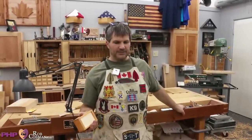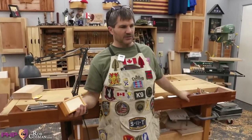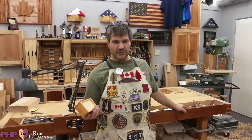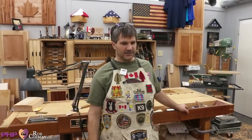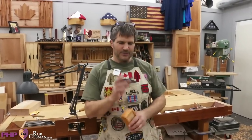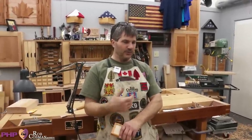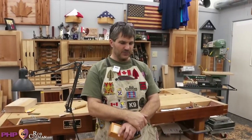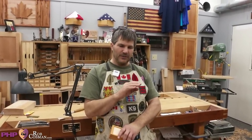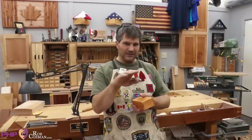Well, you know, there's all kinds of stuff out there today. My issue with it is it's messy, it's not convenient. And I'm not worried about wearing out the stones, because if you're doing chisel backs, which is what uses your stone the most heavily, you only do it once, and your sharpening from then on is mere seconds. So they last a long time. But I'm not big into the film. I was never big into sandpaper on glass. I always thought that was penny wise, dollar foolish. That paper's expensive. It doesn't cost you a lot to get one or two sheets, but when you consider you can only flatten a stone once or twice with a sheet of the paper, then it becomes expensive. And I want my stone sharpening medium to be hard so that it does not give at all under the pressure of the chisel. On sandpaper and glass, you always have that little bit of give in the paper.